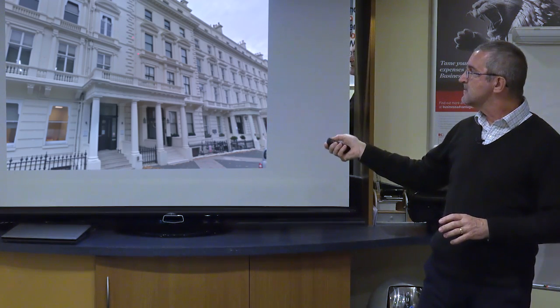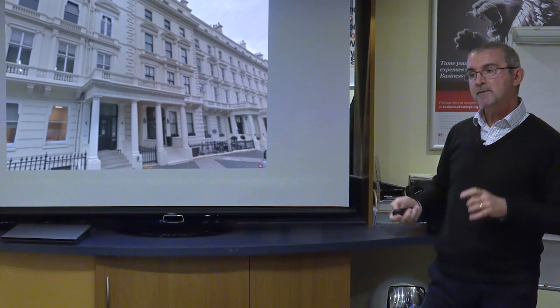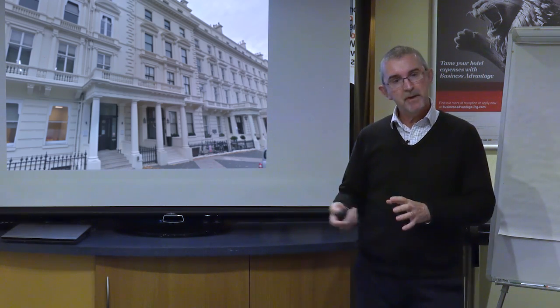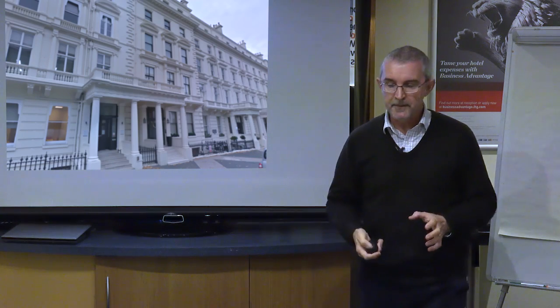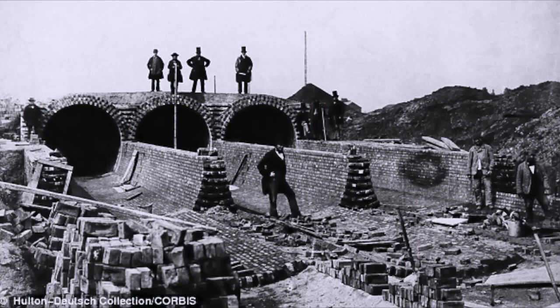So when these buildings have a genuine Roman cement, for a start it doesn't need painting, but if it is painted and it then gets a section of it which is damaged, you've got to repair it with probably a hydraulic lime. It was used to line the inside of the sewers.